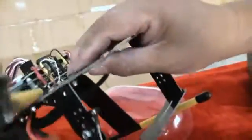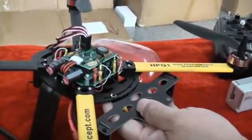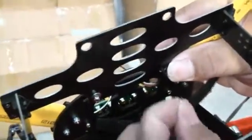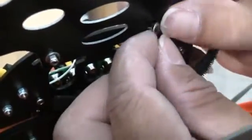I didn't tighten it all the way yet. This is how you mount it. When you're looking at the front, your motorized side should be on your left side, which gives you the full 90 — or close to 90 degrees — downward. Once you mount the first screw, mount the second screw set in there as well. Use your hand to hold on to the bottom side of the screw and your thumb to hold on to the bracket. Flip it on its side, put in the remaining washer, and then the little nuts. It might be a little difficult to hold on to the small nuts, so make sure you have something underneath so you don't lose them.